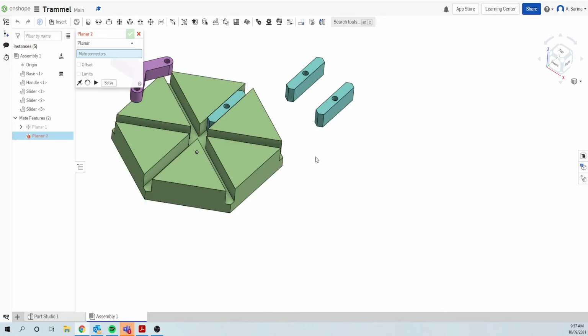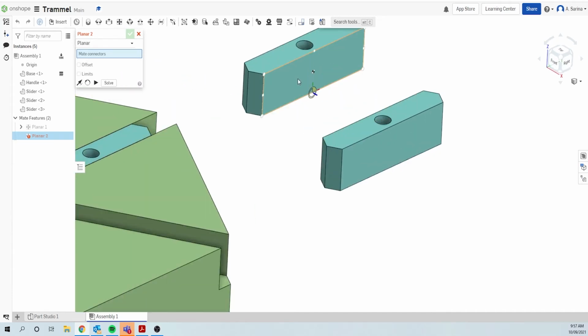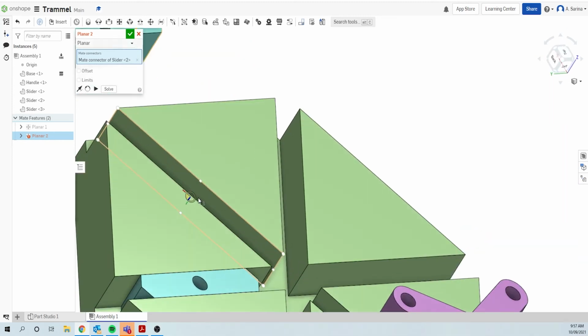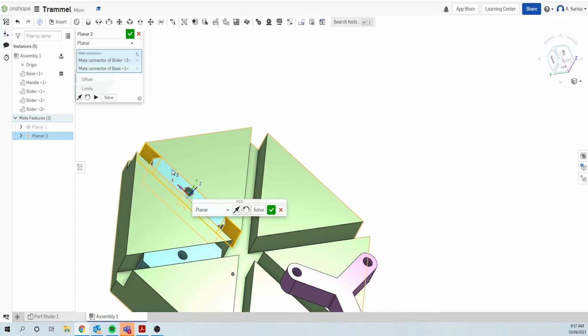Alright, the next thing we're going to do is do another planar mate. So select planar mate at the top, and we're just going to repeat that process again. So I'm going to click on the side of my slider here in the center, and then I'm going to do the same on this next channel. So I'm going to zoom in, find the center of the side of our channel and click. Okay, this time it's put the slider in a way that I'm happy with, so I can just click the tick here.